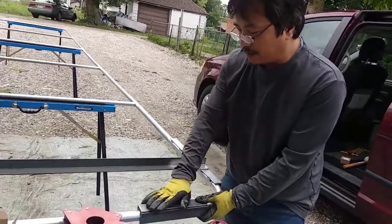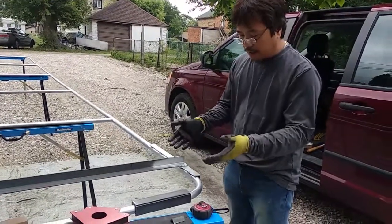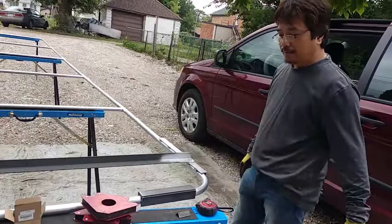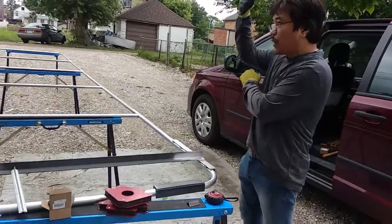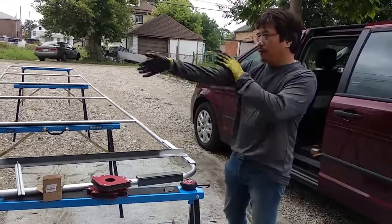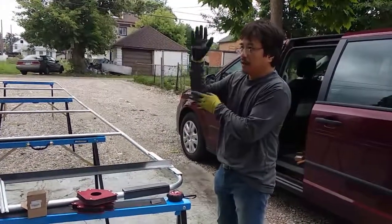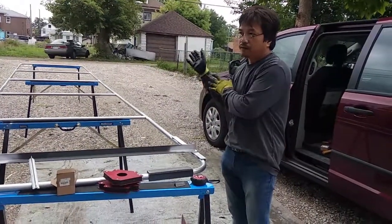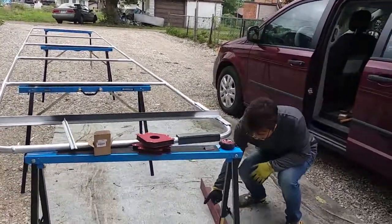It gives the same thickness and extends more surface to contact with the main arm. It does not only support the outside but also adds secondary support to the frame from inside. When the gate opens, most pressure is from outside, but when it starts to drop down, the pressure comes from inside. The gate operates from 0 degrees to 90 degrees — the distribution of force goes from outside to inside when opening, and inside to outside when closing. That's why we need both pieces to support the arm.